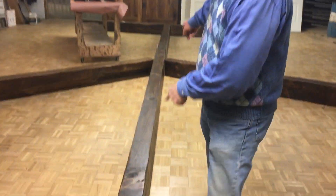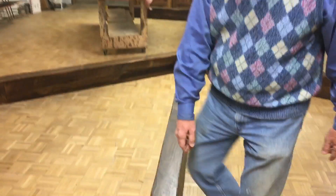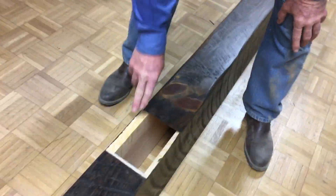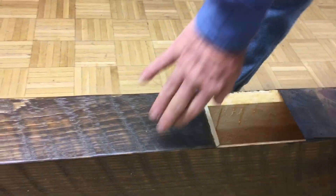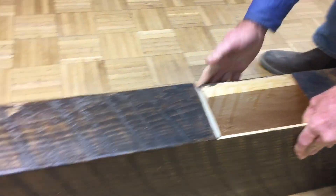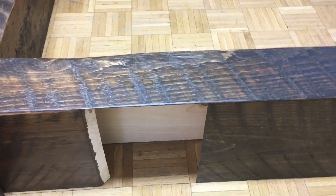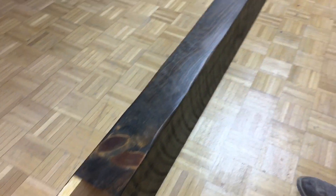This is a ridge beam. It's 35 feet long — cannot get it in the house or transported as one piece. When we're fabricating the three sides, we miter 45 the corners. We'll use a random joint on the vertical, on the horizontal, and then on the other vertical member at different places, so that you have a seamless joint when you reassemble it on site.